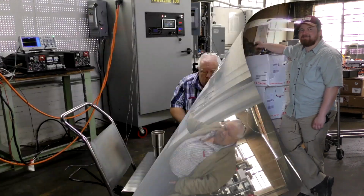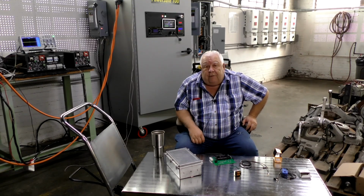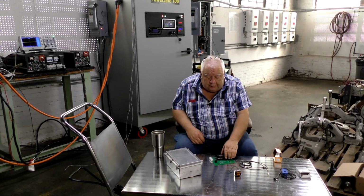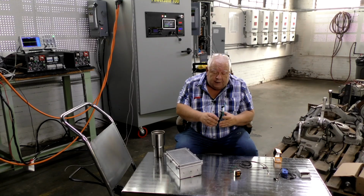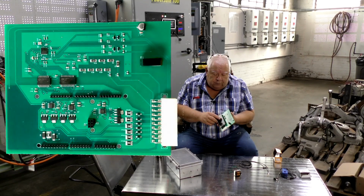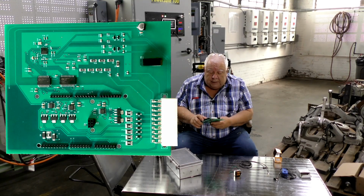Stay with us. Okay, we're a long ways from shipping any of this, but it's something that Colin and I have been working on for 3 months. A lot of it's simply waiting for prototypes from China. We've made a new circuit board that a standard ESP32 CANdue with the 2 CAN ports on it plugs into. You normally see this as a shield. In this case, the main controller is actually a plug-in into the board.